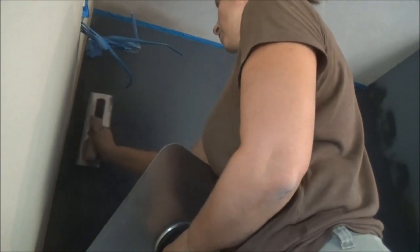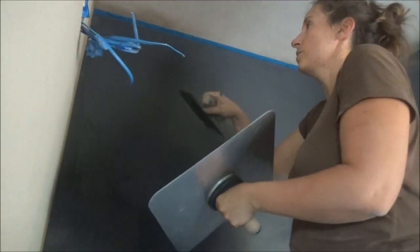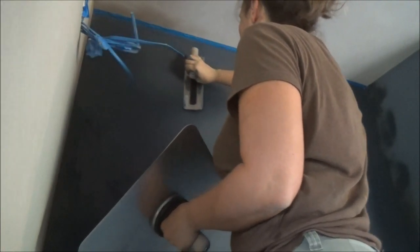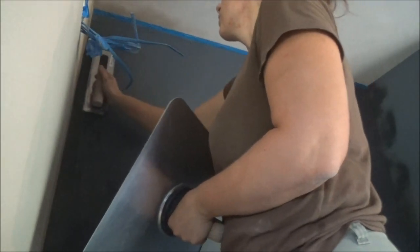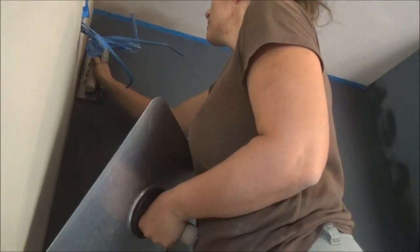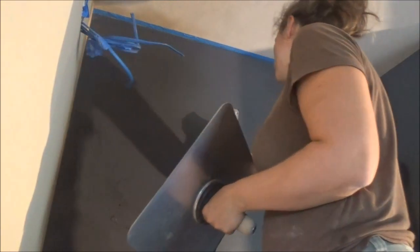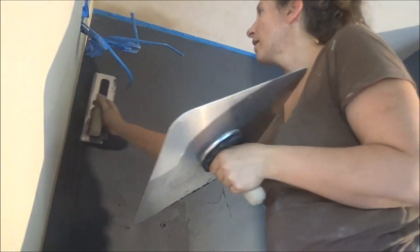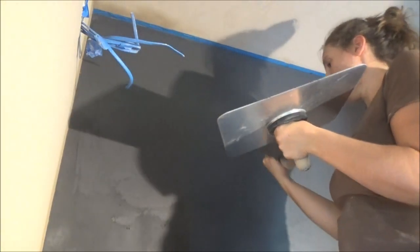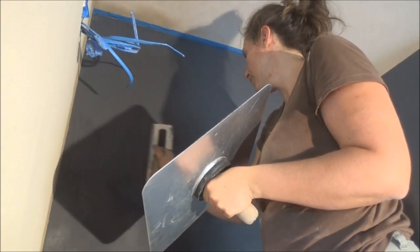When I started out, I took the workshop, and I also read all the material instructions and watched instructional videos, and it turns out I got started putting it on the wall kind of all wrong. It wasn't just the fact that I was working in vertical strips, but I didn't know how to blend the new clay with the old, so I was getting this bump. So I went back and saw Heath in Hood River, and he taught me how to fix that.